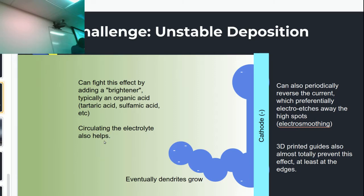There are these wacky organic acids like citric acid — basically a giant half-polar molecule that tends to have some sort of charge with some sort of surface, and it's going to bind itself onto the surface of the high points and actually just block the high-point depositions. Some good ideas are definitely needed here. It's possible that a more mechanical approach — like if I took maybe a bunch of non-conductive dust and had it circulating against there, maybe it would help block the high points — maybe that wouldn't work at all, maybe it'd cram into the low points. You can actually fix it electrically by switching the current density, which preferentially makes the charge concentration work against the high points.